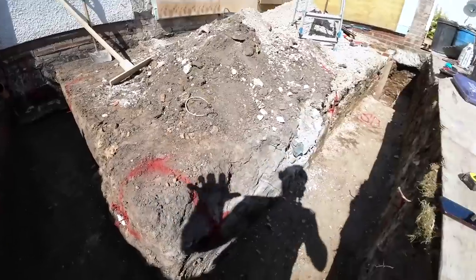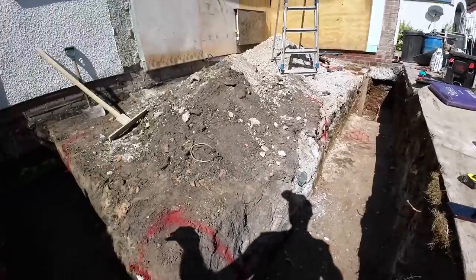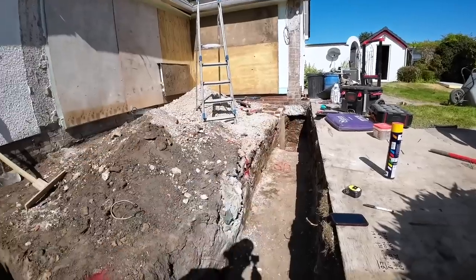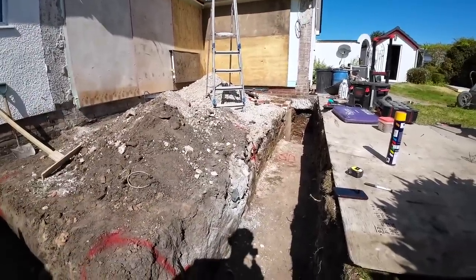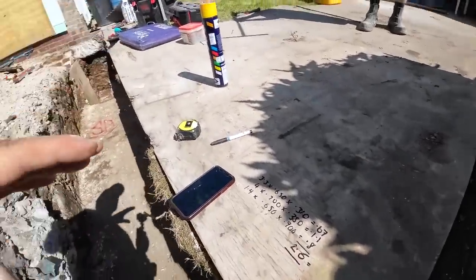It's always slightly over his footings because you can't be sure exactly. So if we can keep it under 3 metres, I'll be happy. This was originally quoted for 750 deep with 1.6 cube of concrete. But as things progressed, we've got the extra labour and the extra depth, so it's going to be slightly dearer on the concrete and then a bit extra on the labour. But this is what happens when you're doing foundations.